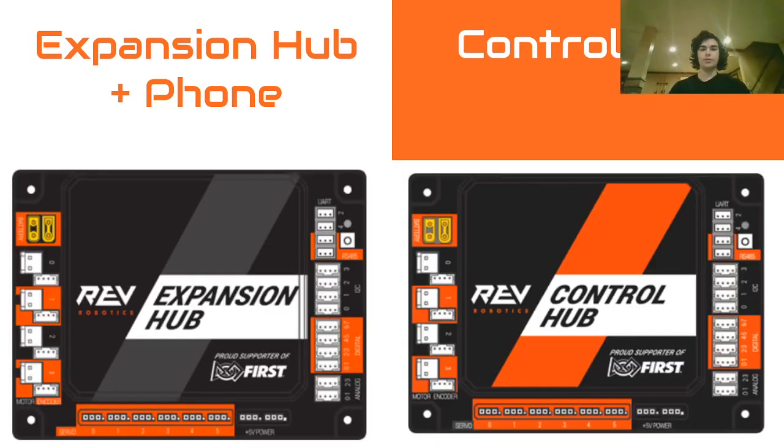So here's a picture of the control hub and expansion hub. As you can see, they are basically the same. I'm going to go over some of the connectors now. You got these yellow connectors, which are XT30 connectors. They're labeled battery very clearly, so that's where you plug a battery in. And there's also a battery out, so you can daisy chain control hubs and expansion hubs together.